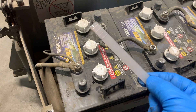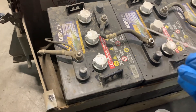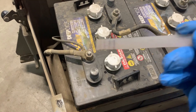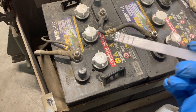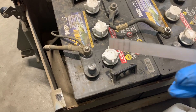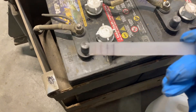When checking the water level, use a dipstick that is non-metallic and preferably won't leave debris inside the battery. Don't use a wooden dipstick — it's not conductive, but it will soak up the water, swell, and become basically a sponge of acidic water. Use something like a piece of plastic doctor blade material. Plastic rulers or scales also work well and give you graduated measurements. I've made my own quarter-inch gradients on mine.